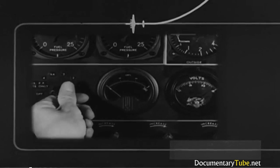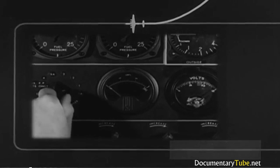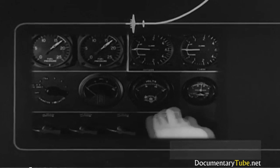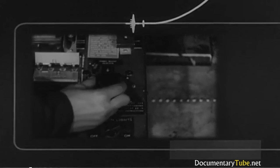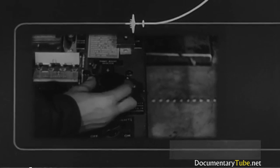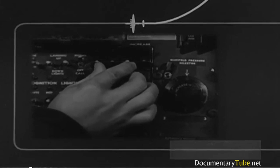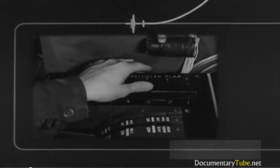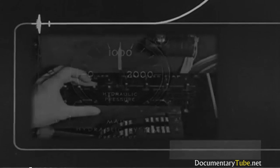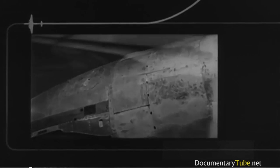On the downwind leg, the co-pilot lowers the landing gear. The engineer checks the output voltage and amperage on all 6 generators and turns on the fuel booster pumps. The pilot turns the turbo boost control all the way up to position 8. It sets the props to 2,400 RPM. Since turbos are now on, the engineer must open the intercooler flaps, check hydraulic pressure, and set the cowl flaps to keep cylinder head temperatures between 150 and 160 degrees.